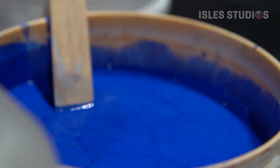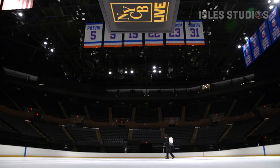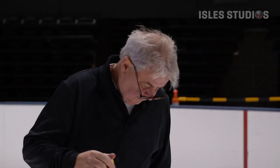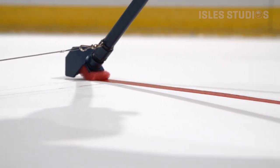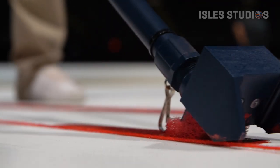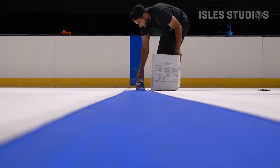The process is actually really quite simple — it starts with a good clean concrete floor. Your first spray is water. I like to put down anywhere between an eighth to a quarter inch of ice, and then you apply white — we apply three coats of white. You want to make sure it's as cold as possible so the paint freezes and doesn't get trampled on. Once you spray it down, you want it to be frozen, then you can walk right back on it.